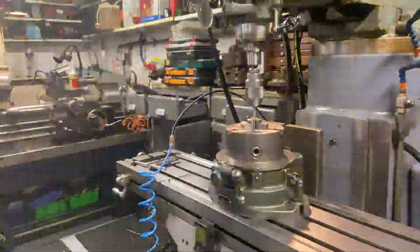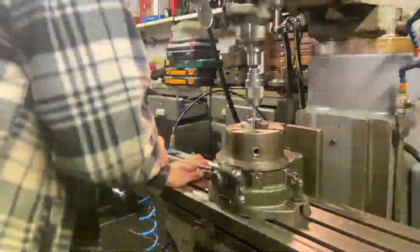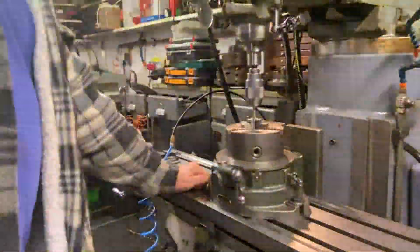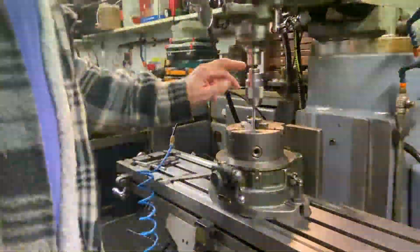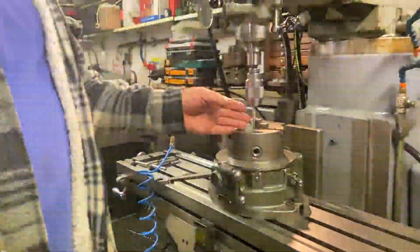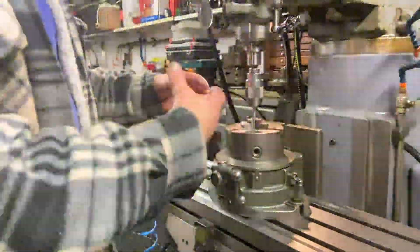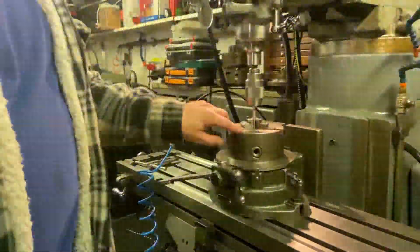I hope you heard my spanner. Clamp it down — that is still held in the chuck. What I then do is set my DRO to zero; I can set my dials to zero if I want to as well. That now means the spindle is exactly over the centre of the chuck, and any job you put in there — because the jaws are going in and out clamping the work in exactly the same place — it has to be concentric to the indexing head.